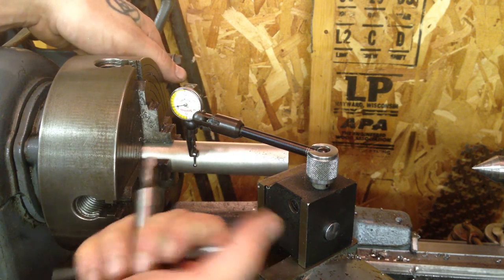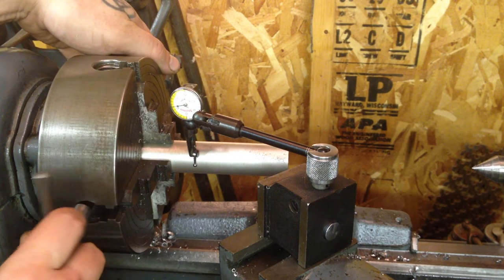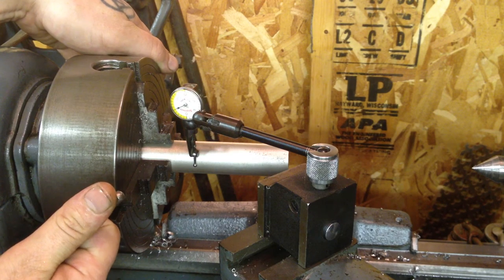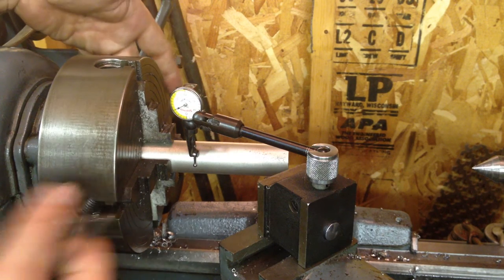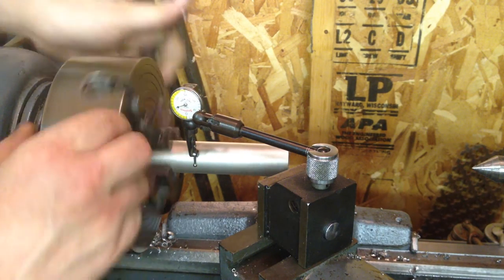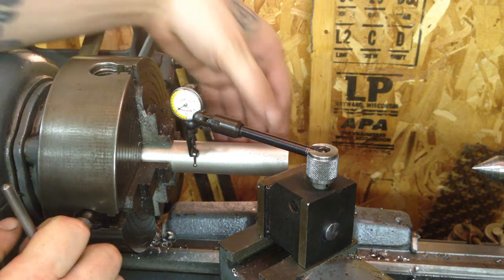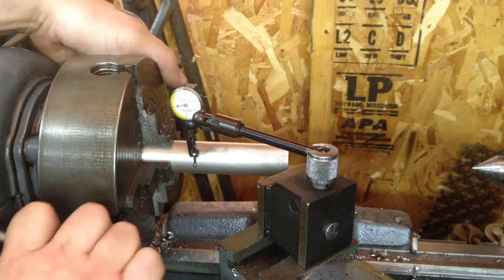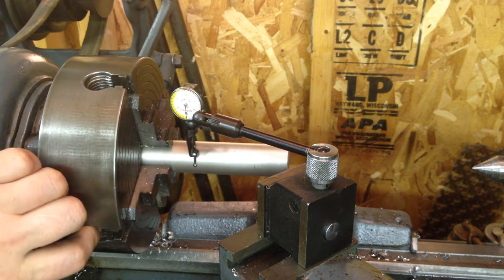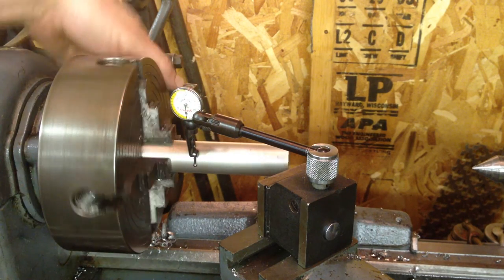If I had two keys I could do both at the same time, but I don't. So I'll get a little crank here. It's already pretty tight, so I need to loosen this side before I tighten any more or I'll just mar the surface. So I loosen it — you can see it's a little wobbly in there — and then I tighten the other side to bring it to zero.